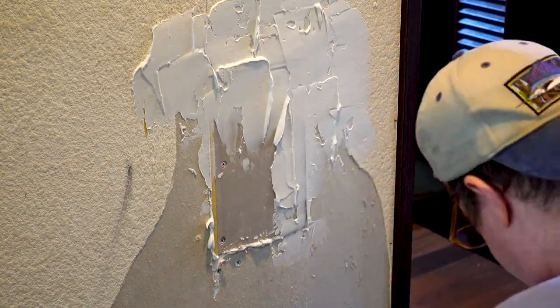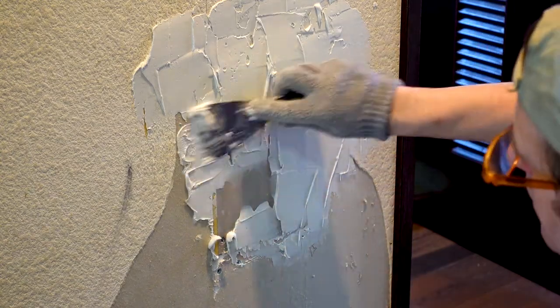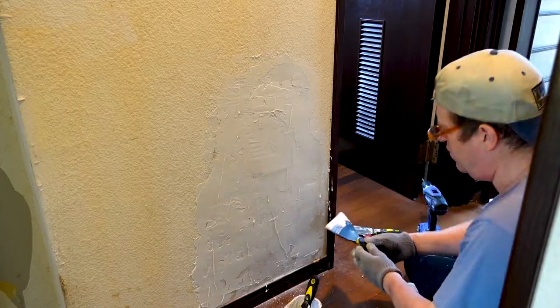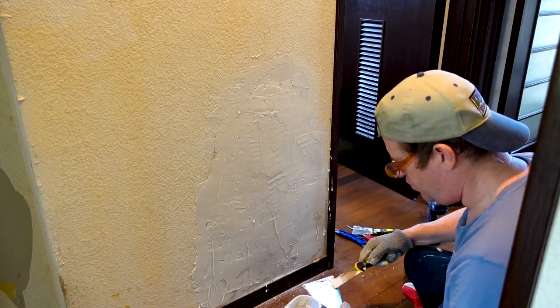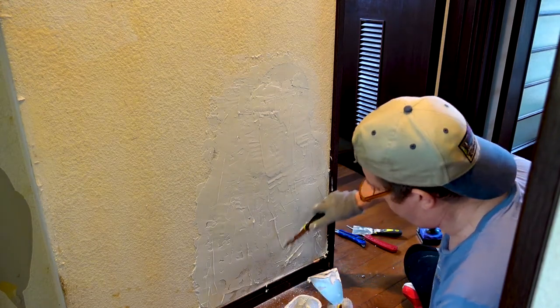Can we use this compound on the hall in our apartment? We can fill the holes with this on the dry. I mean, see, the problem is then you have to peel the wallpaper. Oh, I had to peel the wallpaper. Yeah, and then you got to put the wallpaper back up. You can't use the compound on the wallpaper. It's going to show up. It's going to show up like this. Yeah, it's going to look like this. Like, you see? Yeah, it's like when it dries. Usually you have to peel the wallpaper and then put that and then put the wallpaper back down.